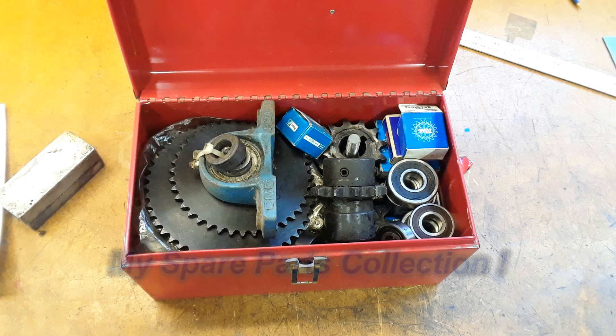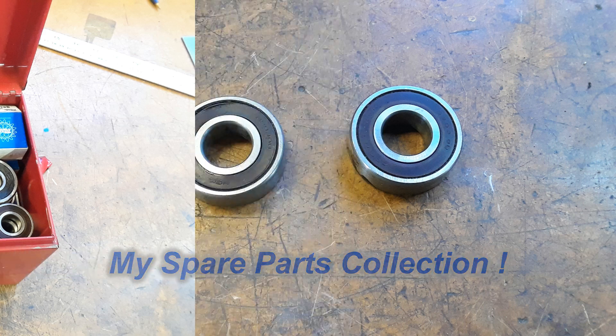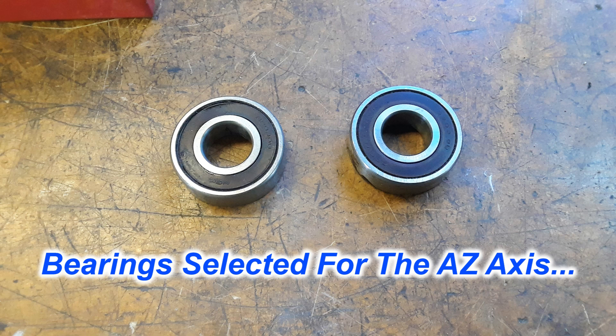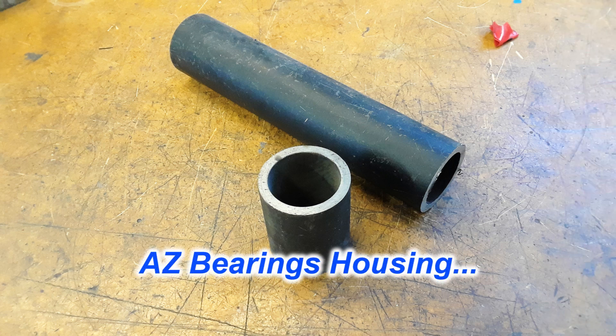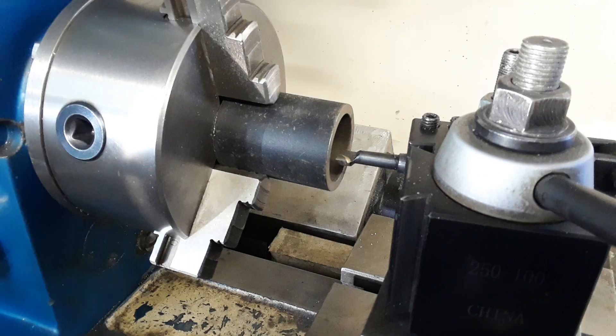The first thing I had to build up was the azimuth drive part to couple his motor. I had lots of parts in my shop from all the other systems I've built over the years, selected a couple of bearings, and still had this pipe I used for building the big dish earlier. I built a housing to hold the bearings into. I didn't take pictures of everything, so you'll just have to go along with me that the bearings did fit inside this pipe eventually, as you'll see.